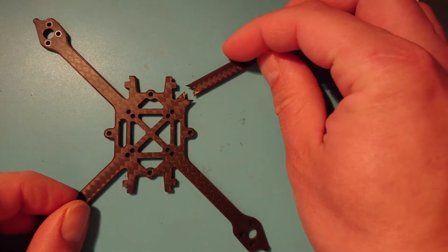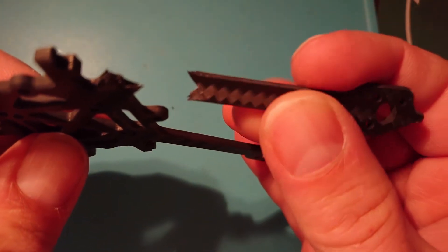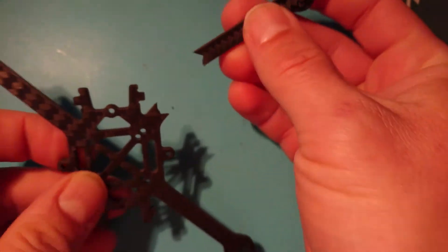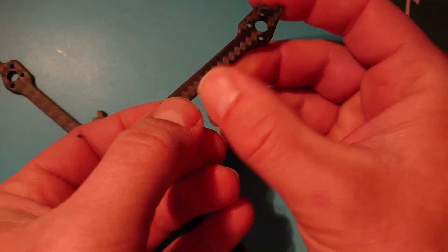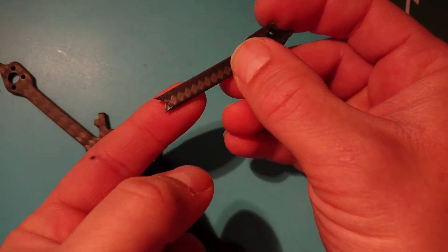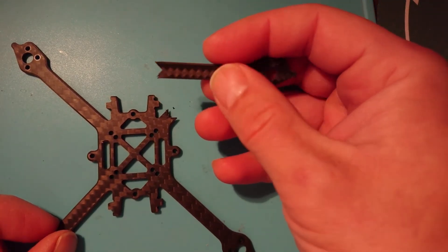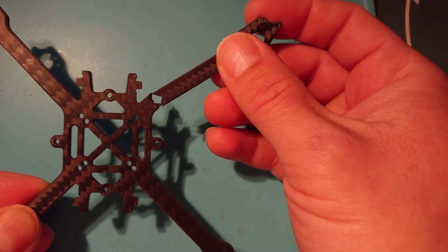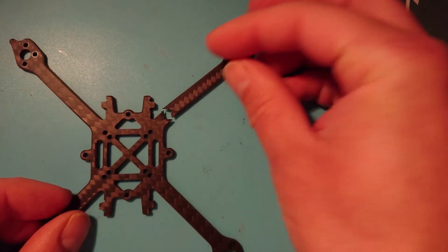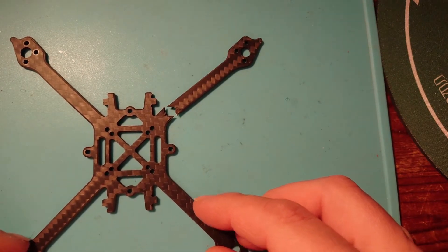Well, the accident has shown me that perhaps that's not quite accurate. The actual break, as you can see, delaminated across the arm itself. Because of the shape it's created, that shape is in fact in line with the outside surface. So it's not a decorative layer or just the outside layer - it's how the carbon is all the way through. Many people would have suspected from the start that the outside layer was indicative of what's on the inside. We can now see more evidence because of my crash that actually maybe the carbon isn't going in the right direction, and that's created a weakness that hitting the rugby goalposts exploited and broke the arm.